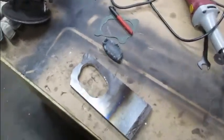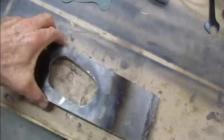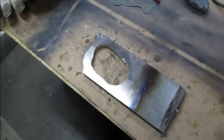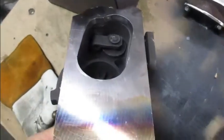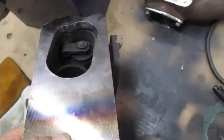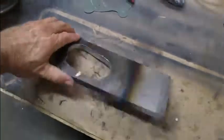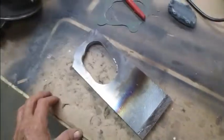I have torched out the center, and then with a 4-inch grinder and some other tools I have cleaned up the middle section. We're going to mount it just like that. Now I'm going to carefully start drilling holes in this thing one at a time so that I don't end up missing any holes. I don't want to have to try and fix something that thick because I missed a hole by a millimeter.